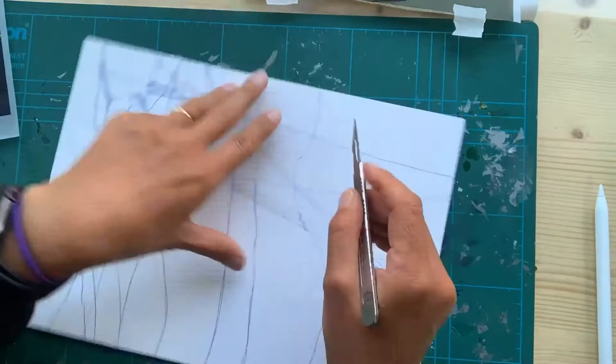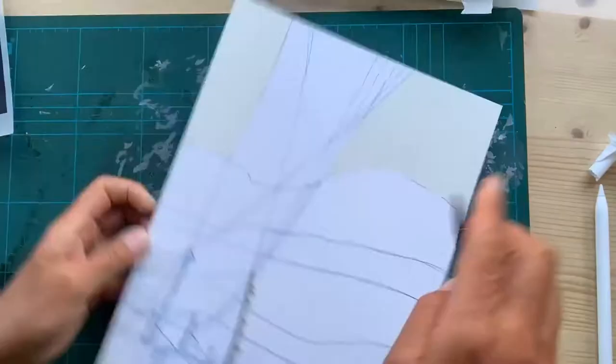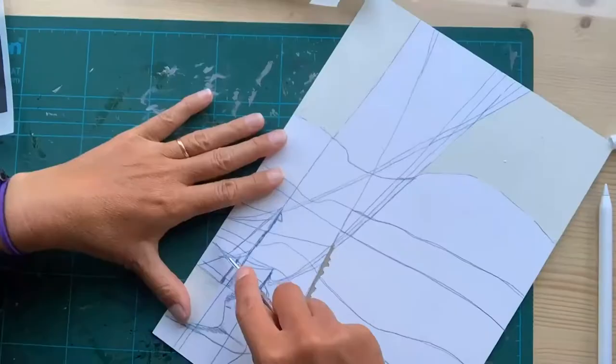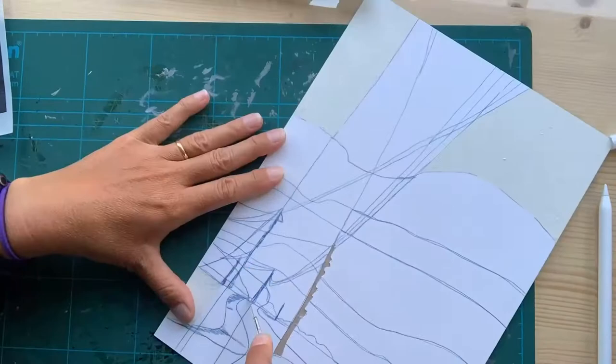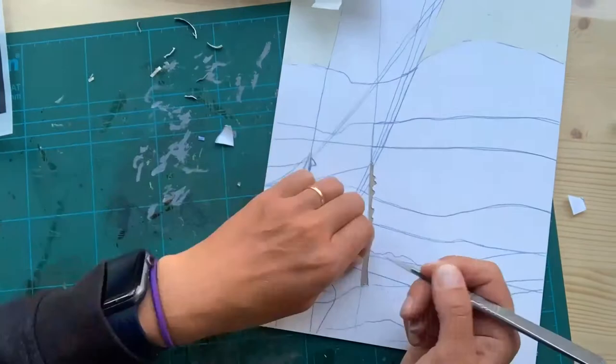In this enviroboard, what's great is that you can have sort of two layers of cutting out — you see the lighter layer and the slightly darker layers. The darker layers are engraved even more deeply than the lighter areas, which can be quite helpful to get some depth in the design, so I use that here to my advantage.